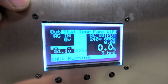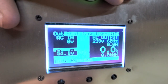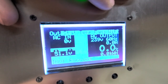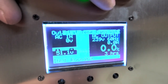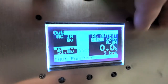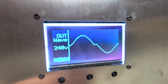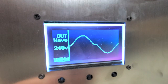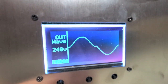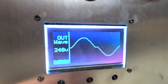There you have it — we're running. This is a brand new interface that Sid came up with to make things easier. We have so much information to squeeze into this screen, especially when you're talking about daisy chain, three-phase, grid tie, and all that — it's a lot to fit on one page. If you saw my previous video, you'll notice we have the new oscilloscope working very well. There's that little blip in the middle — I already explained why — and we should be able to filter that out in software. The sine wave looks pretty much perfect; there's a little bit of a bump here and there, but nothing that's ever going to be a concern even for the most sensitive electronics.